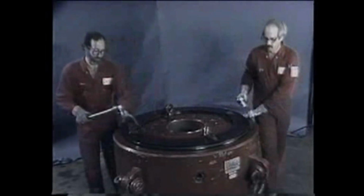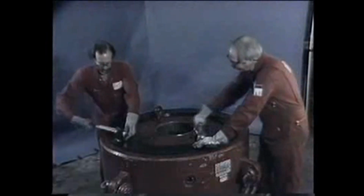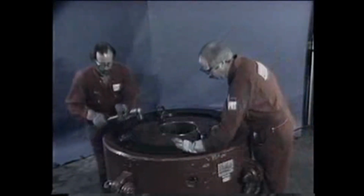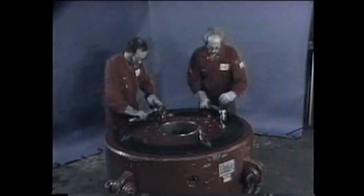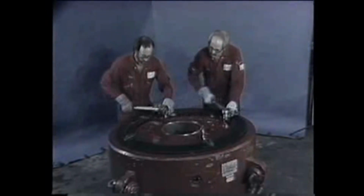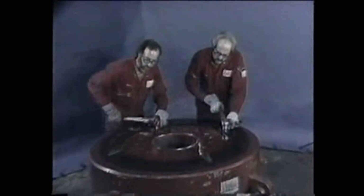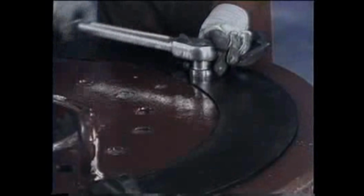The quick-release top is fully locked when the actuator screws have become tight, indicated by application of approximately 100 foot-pounds of torque, with no further movement of the actuator screws. The top trash seal must now be essentially flush with the body.